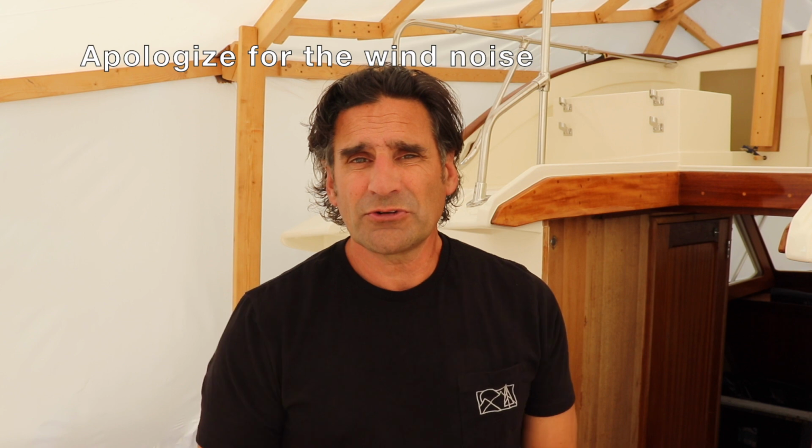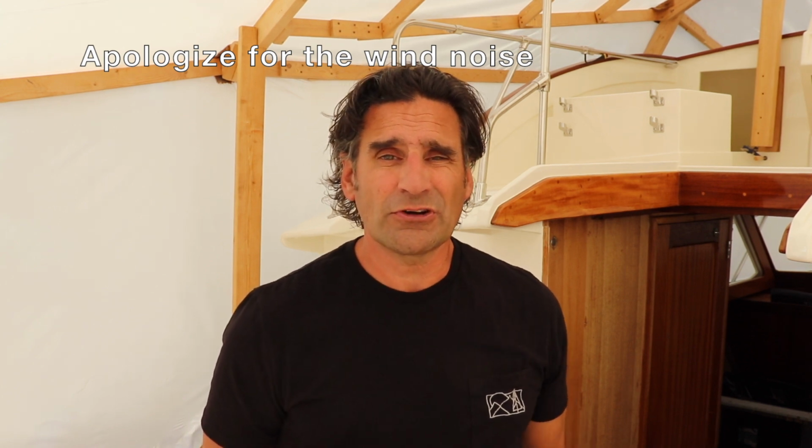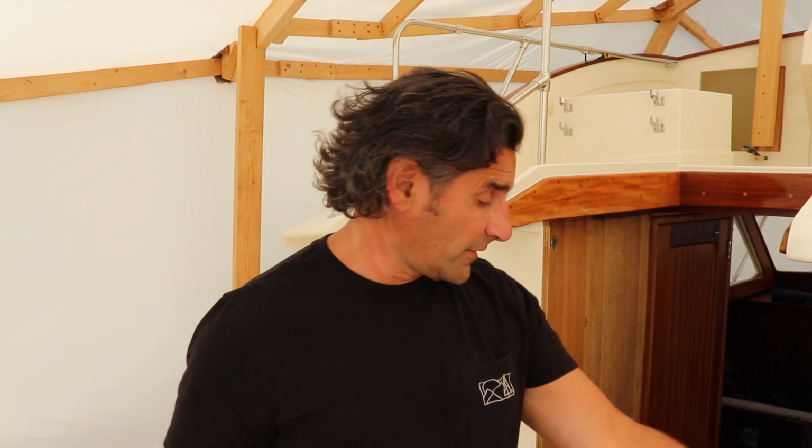Well, hello everyone, welcome to Renovation Sportfish. In this episode we're back to 2019, September, October time frame, and working on putting in the first pieces of plywood. One of the pieces is the piece behind me here, right in front of the main bulkhead, and then the piece in front of the transom back there. So I'm installing those pieces with epoxy and fiberglassing them.